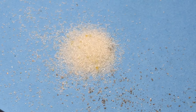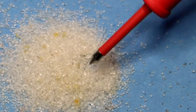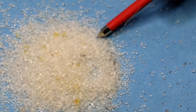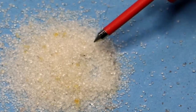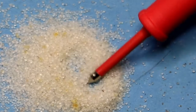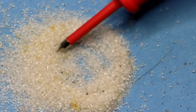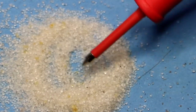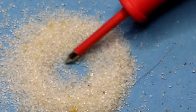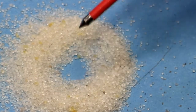Let's see if I can zoom in on that a little bit. Not only can you see the silica particles, but you should also be able to see this very, very thin filament — that is one of the wires inside. This is basically nothing more than purified sand, and this acts as a dampening agent for the actual fireworks that basically take place inside this fuse when it blows.